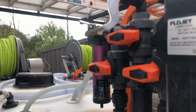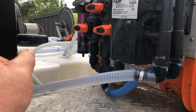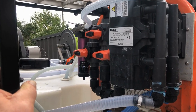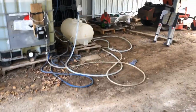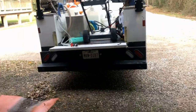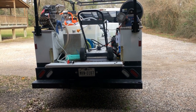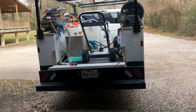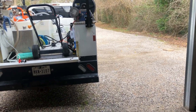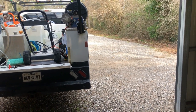One thing that's very important, no matter what method you use: you want to make sure that you rinse your pump really, really well — the hose and whatever you're using. That's why we have a water tank here, so we can put our inlet hose in there when we're done. What we'll do is push a little bit of water into the tank — not enough that's going to hurt anything — and then once I know there's a little bit of water in, I pull the hose and lay it out into my grass or yard or driveway and just let water continue to pump through the pump for four or five minutes.